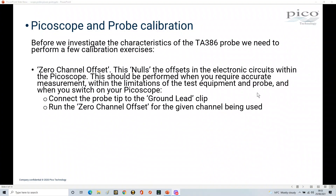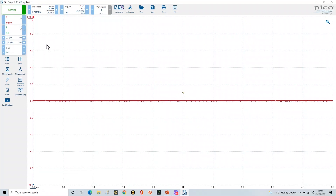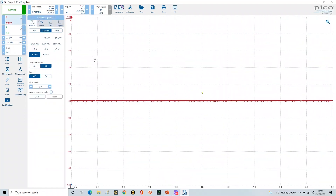I'm going to go through this in detail now. I'm not trying to teach you in this particular video how to use the PicoScope — I'm going to do separate videos for those elements. What I'm going to do is show this from powering up the software, starting up the software, and going through this process. So I'm going to leave the presentation for a minute and open up the PicoTech software. Here we have our PicoScope screen, and if I go to Channel A and click on it, you'll see there's a 'zero channel offset' option, which is what we're looking at here.